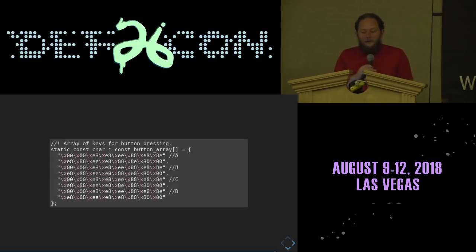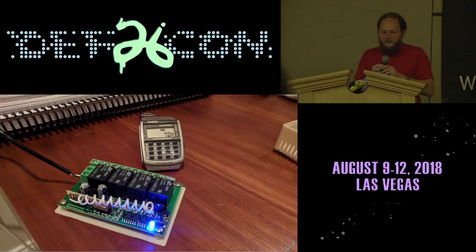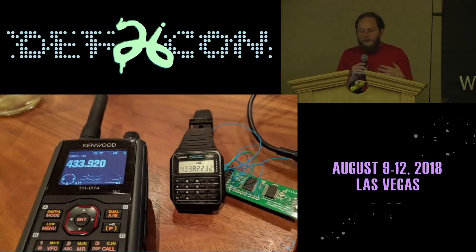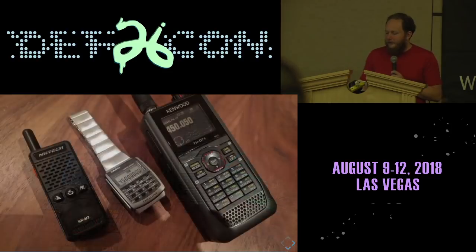You also need the packets themselves. So here we have four strings broken apart into eight lines, and these are for the A, B, C, and D buttons of the transmitter. And then at the end of it, you have a working signal that you can send. You can also send this between devices, right? So here I'm transmitting as Morse code to my handheld radio, the Kenwood D74.